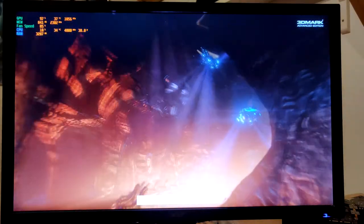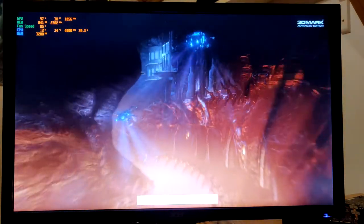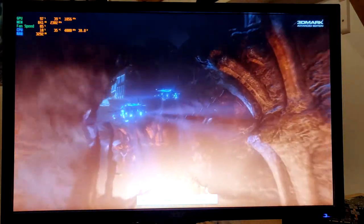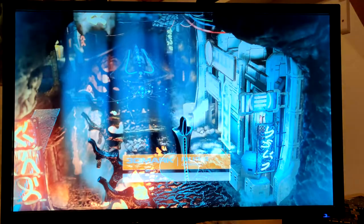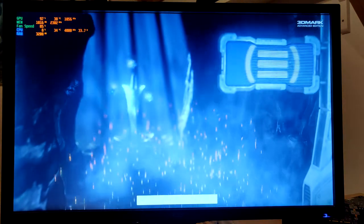The best one would be the Power Edition Lightning, which actually has a really annoying thing, because I can't run that one direct die because it won't work correctly. You need a very specific amount of mounting pressure for it to work. If the mounting pressure is just very slightly off, you're gonna get artifacts. I already reflowed that card so many times. I'm pretty sure the BGA array is completely okay, and it's something different causing the card to not work properly, because it's not the only card I have with this problem. The 560 Ti 448 has the exact same thing.